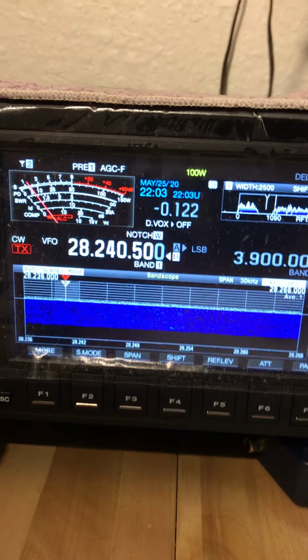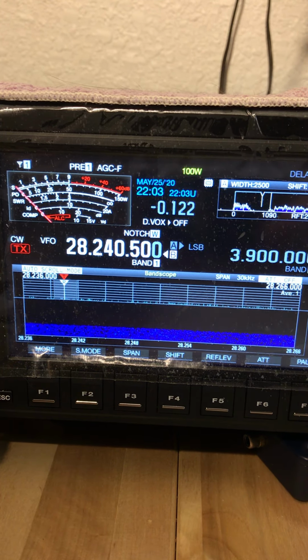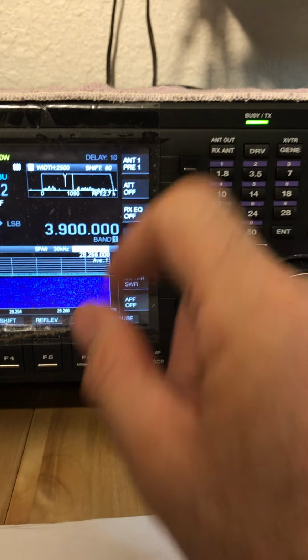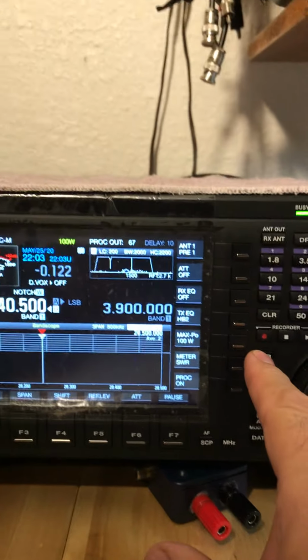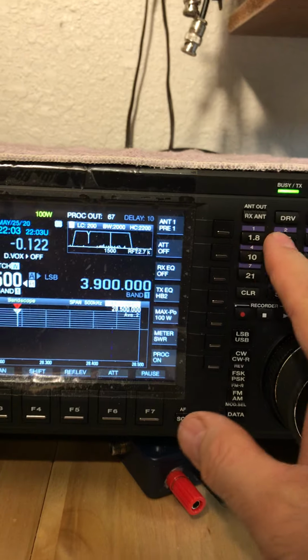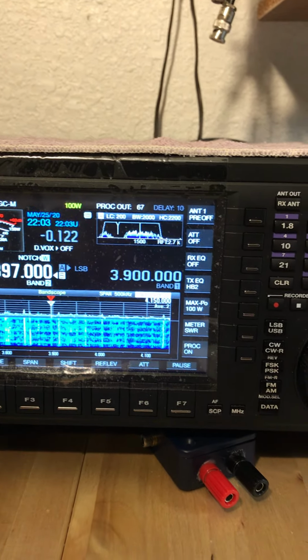Now the interesting thing is, when I go to antenna 1, I need to actually go over to my inverted L, my 160 and 80 meter inverted L. To do that, I just reach over here and switch this up there. And then we go back to antenna 1, because that's where that one's connected. And go back to upper sideband. I was seeing spikes here before, but now I'm not seeing anything, which is expected, because it's not cut for 10 meters. It's cut for 80